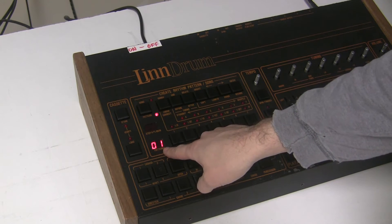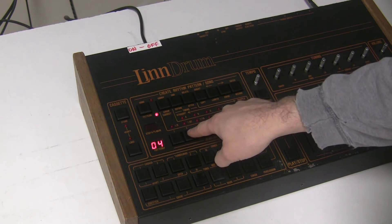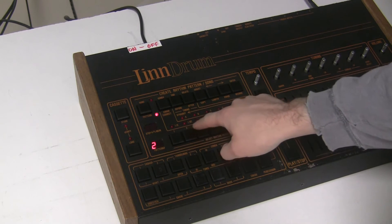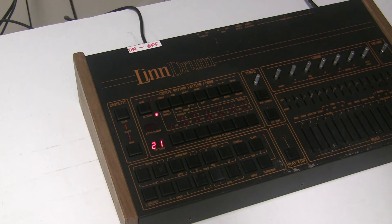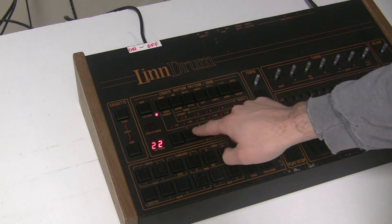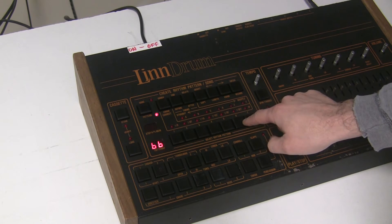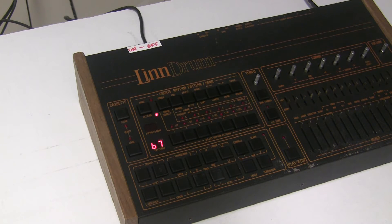Pressing 11 puts 01. Pressing 12 gives 02, and so on. Pressing 21 works. Trying 22, 23, 24, and 31 - it seems like a 1 shows up as a 0, a 2 shows up as a 2, a 3 shows up as a 2, 4 as 4, 5 as 4, 6 as 6, 7 as 6. So it's losing a bit of that digit. We're closer but not quite there, so I'm going to open this up and figure out what is causing this to display the wrong number.